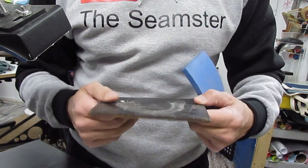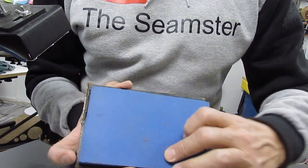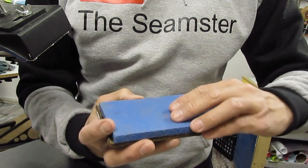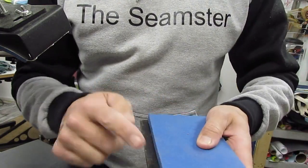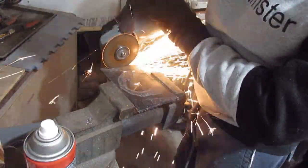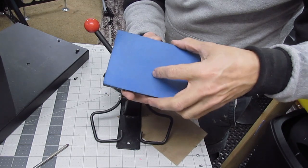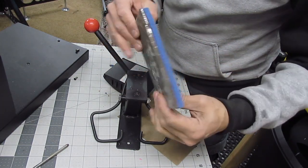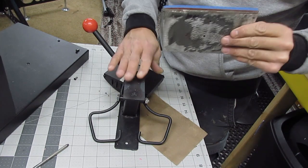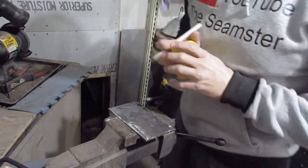Lucky for me I have some leftover quarter-inch metal plate and it seems to be almost an exact fit for what I need, except I just need to trim off a little bit there and across the top. I'm going to make my marks, take my cutting wheel grinder, and go ahead and cut that off. I've got my piece cut that I want to use. I'm going to save myself the agony of drilling holes and putting screws in, since this is going to be a permanent thing. I'm just going to go ahead and weld this plate.